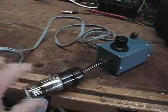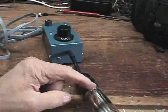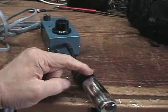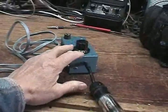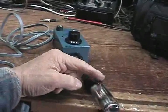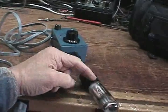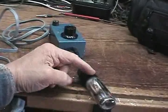This particular tube is extremely weak. This is a handy thing to check tubes. When you're at a radio flea market and you want to test a tube, if you've got a place to plug this in — you could probably make this battery operated. You just need a way of generating the target voltage. In this case, the target voltage is only 125 volts going on the target of this tube, so therefore it's not going to light as bright.